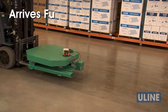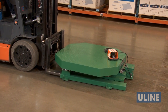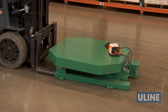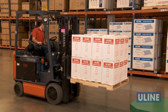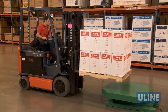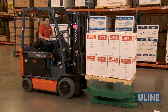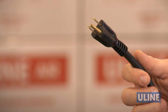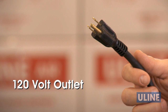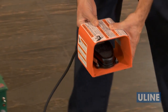Your high profile turntable arrives fully assembled and ready for setup. Once the unit is uncrated, transport the machine to where you'll be wrapping your loads, making sure there is sufficient room to load and unload the machine. Also, ensure that the floor is able to bear the weight of the machine, load, and equipment. Once placed, simply plug the turntable into any standard 120-volt outlet with a minimum 15-amp capacity and position the foot pedal in an open location.